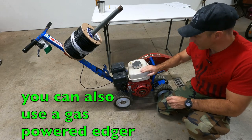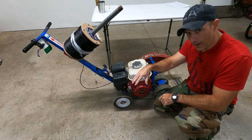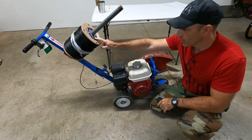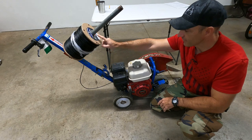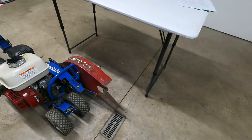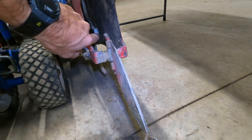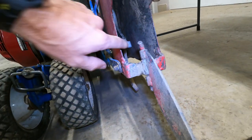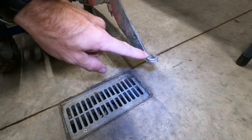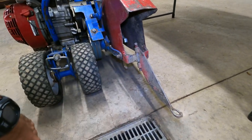Right here is the machine I rented. This machine will actually dig the little trench, bury the wire, and kind of fill the hole back in all at the same time. This is a spool of 1,000 feet of 14-gauge dog fence wire — I'll link that in the description. You don't have to use 14-gauge; 16-gauge would probably work too. Down here is what digs the little trench — maybe half an inch wide. The wire gets pushed into the ground and the dirt flies out the top to fill the hole back in.